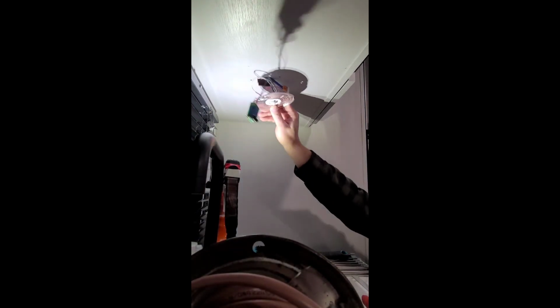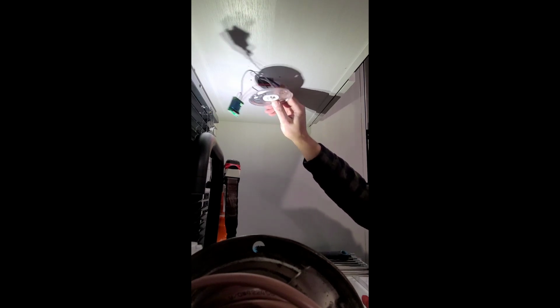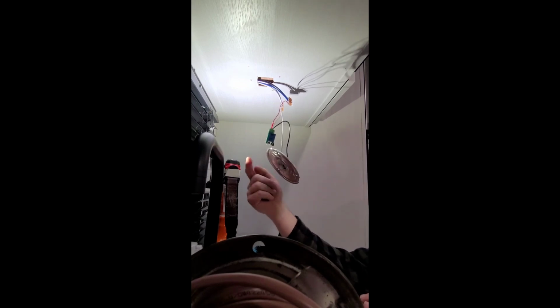Just make sure when you cut that out that your footprint, your cutout, isn't any bigger than the footprint of the light. If you're unsure, you can take a pencil and just trace a circle around there. So when you pull it off, you know exactly what your footprint's going to be. Pencil washes off of wood fairly easy, with soap and water. Worst case, you use the eraser. But other than that, guys, I think this is a wrap. All right, thanks for watching. Bye-bye.